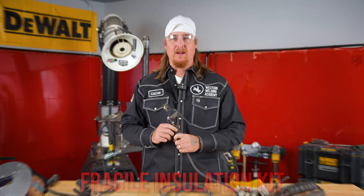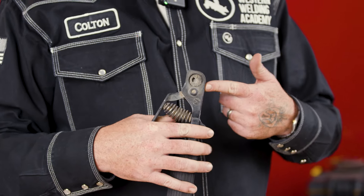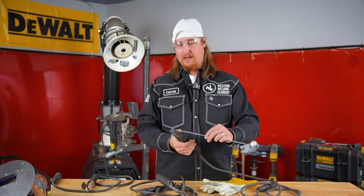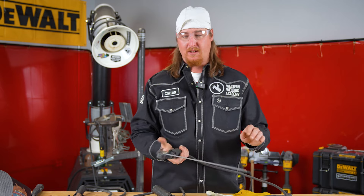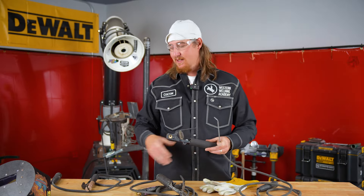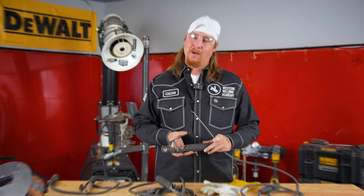The downside — same thing: if you throw it on the ground, the insulation kit on top will break. Luckily V Stinger sells a replacement kit, so when you break your insulation kit but your stinger's still good, you just spend 30 or 40 bucks and get a new insulation kit. This is my preferred choice for fabrication in a shop where they require an insulated stinger — it's a little bigger, fits my big hands, and is way more comfortable. Once you put that rod in there, it's not moving. The hole completely closes up and it'll run all the way up to a 5mm or quarter-inch rod. This is a 300 amp stinger.